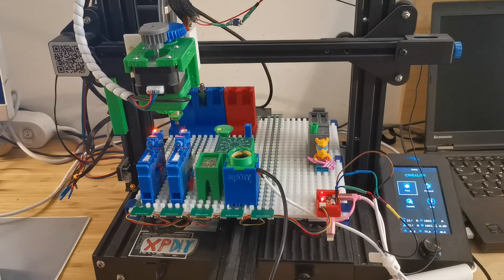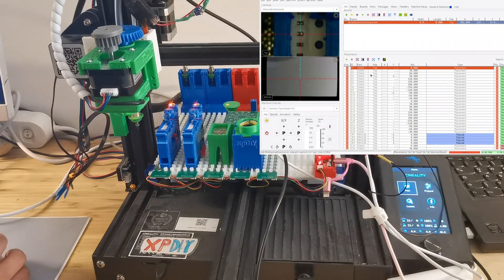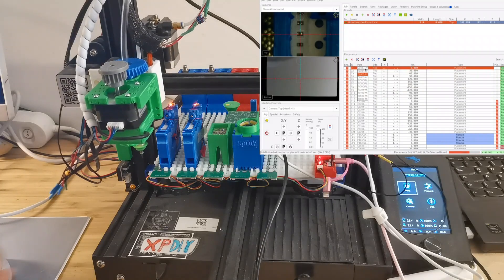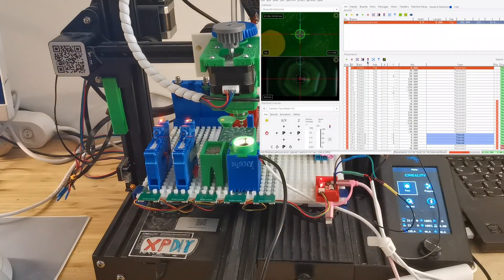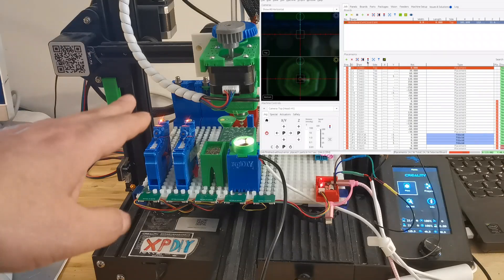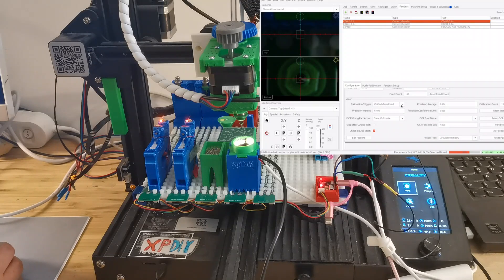Now I will start OpenPNP. I have started OpenPNP and what I need to do first is the homing. While doing the homing, I will set the parts to unplaced. I just set the 0402 component to be unplaced. You can already see the movement of the head is already faster, and for calibration you can see there's no need to go down anymore. Now the calibration has been done, so I'll set up the feeder — I need to set up the placement so you can see here on each tape feed.